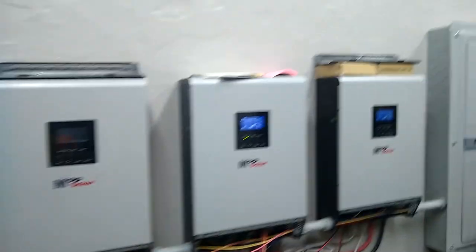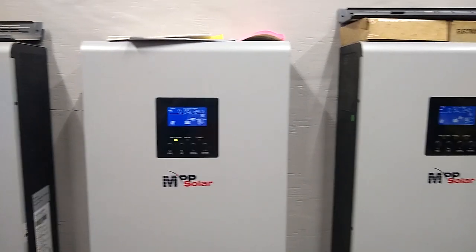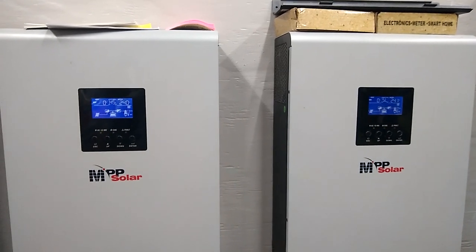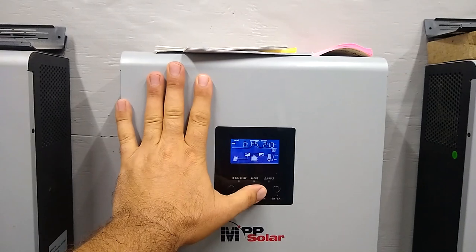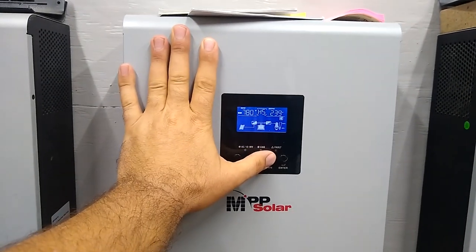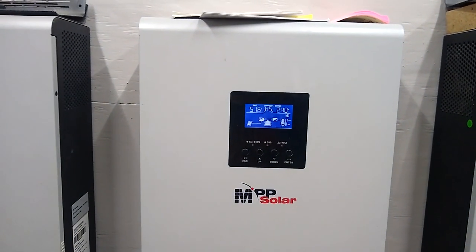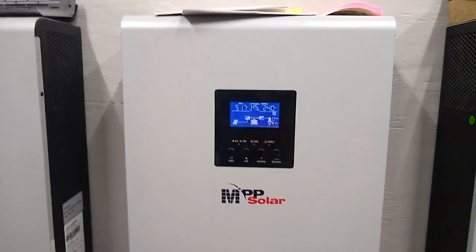And then we can flip on our solar panels, and there we go, and now we're charging, and we should be pretty close to full because we were floating when I turned these off. Yeah, 51.6 volts. So, oh, and I'll need to reprogram this now for 24 cells.